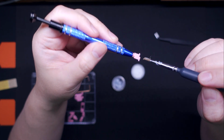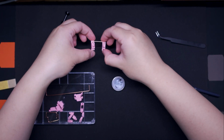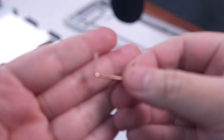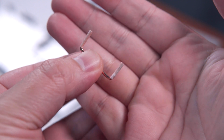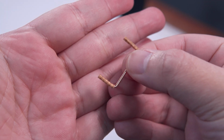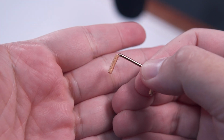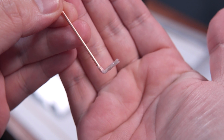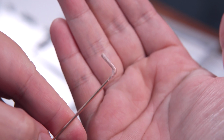I also lubed and fully modded the C3 Equalz stabilizers with Krytox 205 grade 0 and Mediplast. By the way, I also did another test using Micropore wrapped around the wires, and I had to use Micropore instead of a band-aid because the Mediplast band-aid is too thick to be used for wrapping the wires. It was too mushy even with just the Krytox 205 grade 0. Later, we'll have some sound test comparisons so that you can have a better understanding of what I'm talking about.